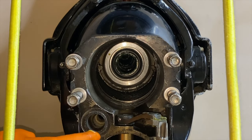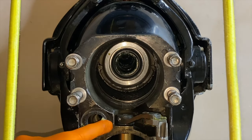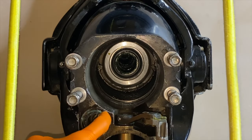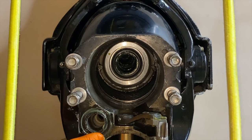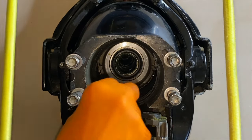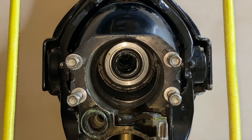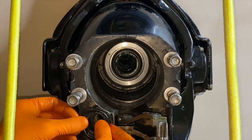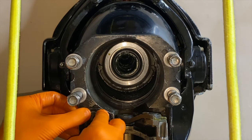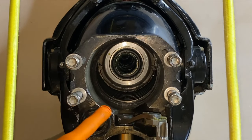I'm now going to insert some grease inside the machine cut where the water tube O-ring is going to seat. This will help keep the O-ring in place as I shift the out drive on and secure it. No reason to get messy or add too much — the biggest thing is you want it there. Clean up the outer surface and go inside the insert where the water flows through to make sure there isn't a pile of grease in there. Now seat the water tube O-ring right inside that little insert, and use the grease being pressed out on your finger to lubricate the outer portion of the O-ring.